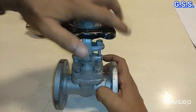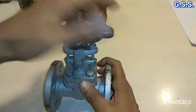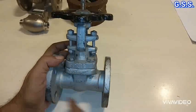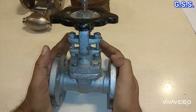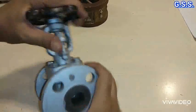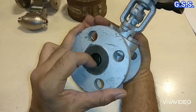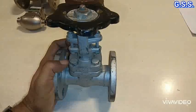This is one flanged gate valve. For shell testing, we keep the valve wedge fully or partially open, provide blank flanges on both sides, and pressurize from one side so the entire valve body and bonnet is pressurized — checking for any leakage. For seat testing, we close the valve fully, provide a blind flange, pressurize from one side, and check whether any leakage is coming from the other side and whether the leakage rate is acceptable. The same is then done from the other side.